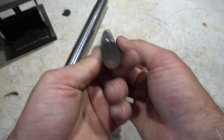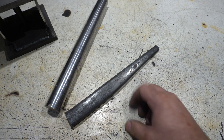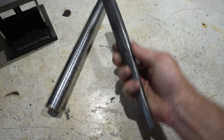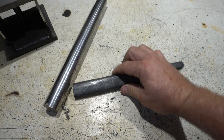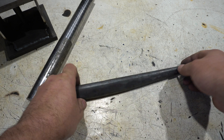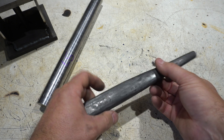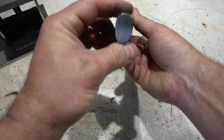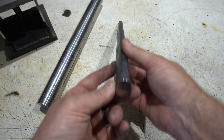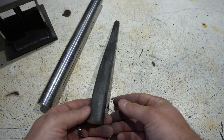I was pretty happy with how well this went, and this is S7 steel. I didn't show the hardening process because it's pretty trivial — you just take it out of the forge and air cool it. I put it under a fan and it came out around 55, just below 55 HRC. It was skating a 50 file and not quite skating a 55, so it's between those two. This one is kind of oval so it was hard — I didn't try this on the HRC tester just because it's round and moves around a lot, so I didn't bother.